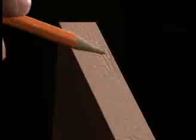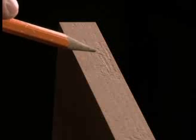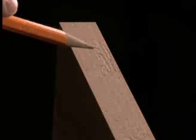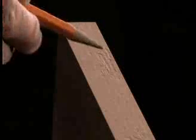The amazing thing is that this was torn by my number 4 plane, cutting at 45 degrees. So it's not even a low angle situation yet. It's just normal pitch or regular pitch. But I did so much better with the York pitch at 50 degrees.